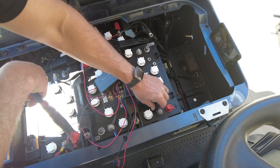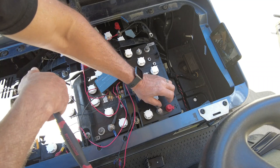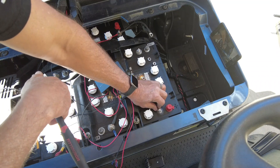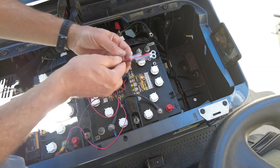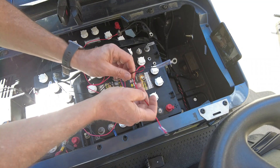They could be flooded or AGM. This balancer is going to keep the batteries within probably a tenth of a volt of the same. Batteries go bad because the voltage starts to vary — regardless that they are the same age and same manufacturer, they will over time vary.